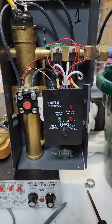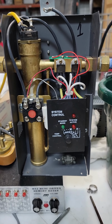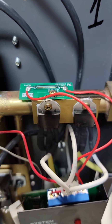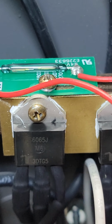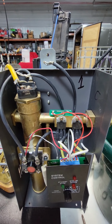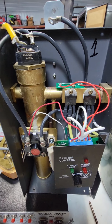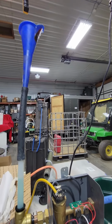Richmond Encore water heater, point of use electric water heater, and I'm currently descaling it. I have a problem. The flow sensor, it's a magnetic reed relay, stays on after the water is shut off, and so therefore the main tank breaker will trip. So I'm descaling right now.